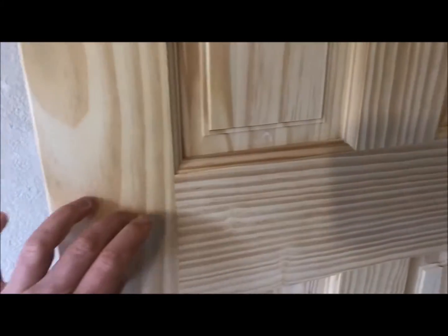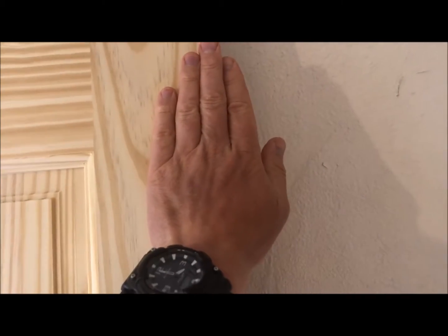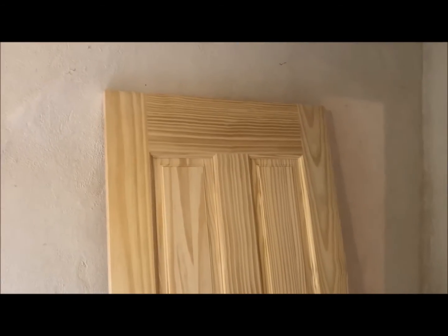We'll then use a surface latch mount, which just goes over the top rather than having to chisel it in. And instead of chiseling our hinges and rebating them in here, we'll just mount them flat on the surface. And so that's our quick way of mounting a door, which if a builder or carpenter did it for you, you'd probably be a bit disappointed. But if you just want to get your door up and working, then why not follow this method? Anyway, we'll do the first bit and then we'll video again in a minute.